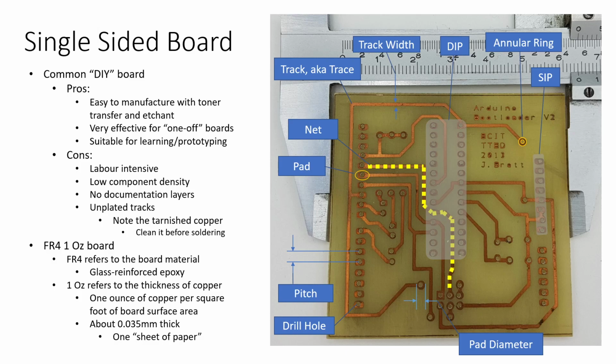But in a commercially manufactured board, you'd get a solution and you'd have these plated, usually with a tin type of coating. You can get a plating solution that you can dip your homemade boards in and they will automatically plate themselves. It tends to be a little bit stinky, a little bit expensive, and probably not necessary unless you're really going for some high quality finish on there.